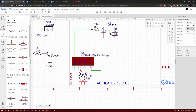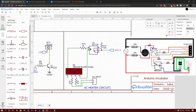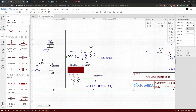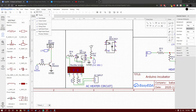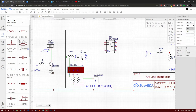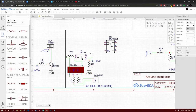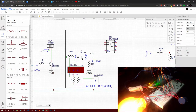I was following a circuit diagram by a great YouTuber, Techie Sims — I'll link to his video and article in the description. I was also using a source from Electro Noobs, who also has an article. By improvising and mixing both of these codes and circuit diagrams I was able to come up with a circuit that worked perfectly for me. Now I'm connecting the collector (pin 5) of the MCT2E directly to 5 volts and connecting the emitter (pin 4) to ground through a 1 kΩ pull-down resistor. I'm connecting a wire directly from pin 4 (emitter) of the MCT2E to Arduino's pin D2.